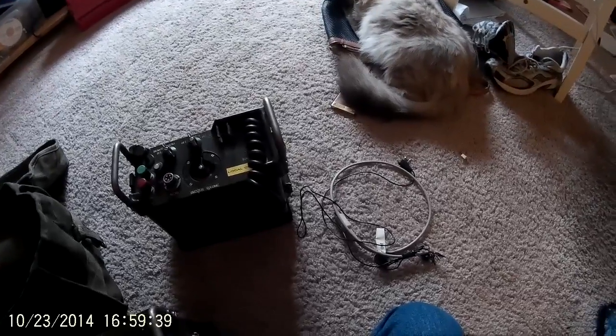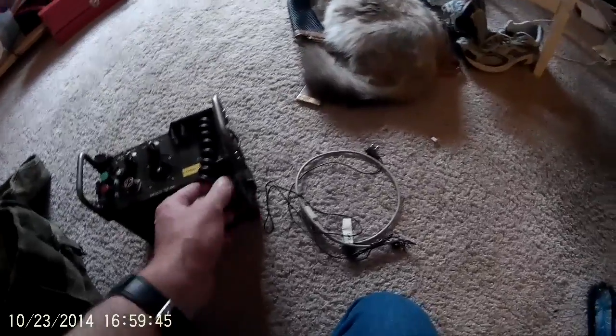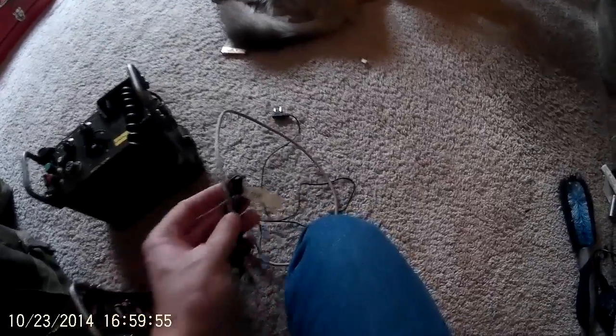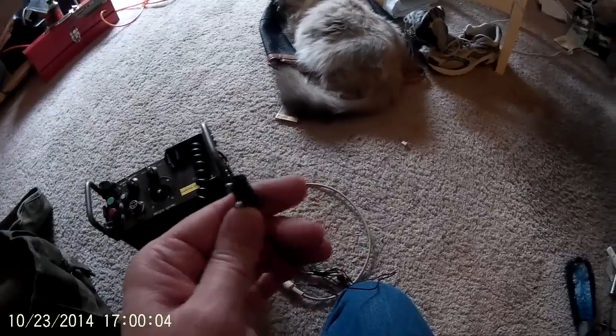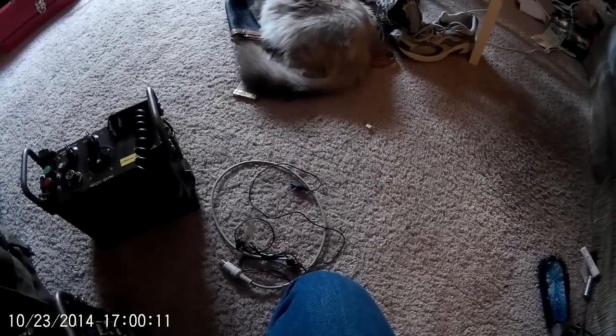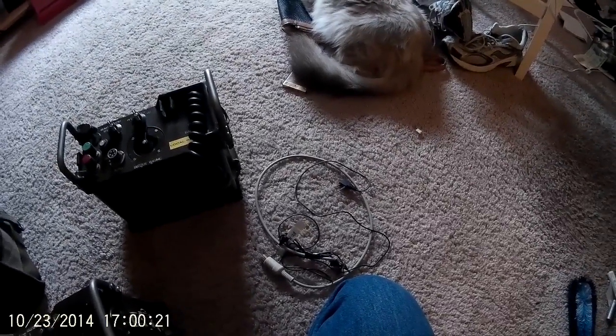What it does is it's a microphone amplifier that needs a 9-volt power supply to run. It's a preamp and it amps up the signal coming out of here enough that it will work with a civilian radio. I've rigged up this interface cable to go between my amplifier and one of my handheld GMRS FRS radios, scrapping one of their cheap remote microphone units. It's currently rigged to operate on the VOX system, but I need to redo the cable and key the radio directly so it's faster to respond.